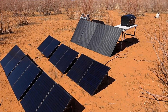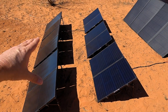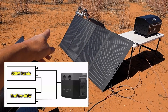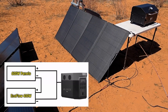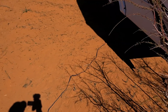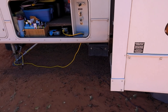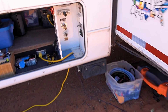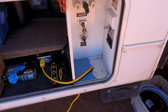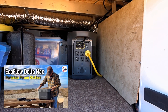When I put both sets of ground panels out, they're wired in a specific configuration. The rigid panels are all wired in parallel at 24 volts, then I series them with the EcoFlow flexible panel which is around 50 volts. From there I use a 25-foot cord that I run back and into the RV through the water bay — there's a hole for the hose — and inside to where I store the EcoFlow power station.